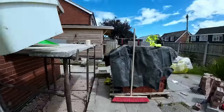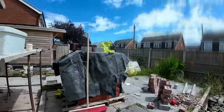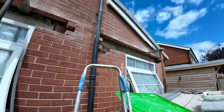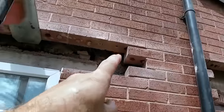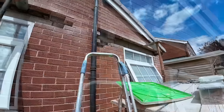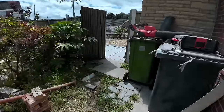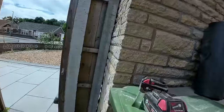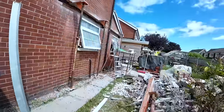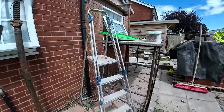Alex has finished cleaning the bricks. We're going to need a few new ones because we've broken a couple. And we took three cracked ones out as well, and two broke on the way out because they're not very good, those bricks. You can see the holes are different bricks. Not a bad match, but different bricks. But yeah, sun cream's on now because all the dust is over. So I'm going to get this lintel in, get the tray set up, and get cracking. I'm always getting on the scaffold then, get this one blasted in, and get set up on this one for later on. Right.